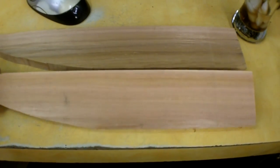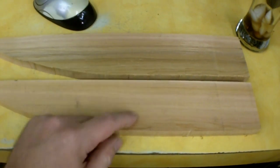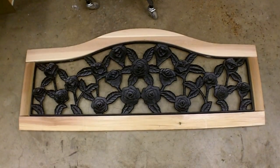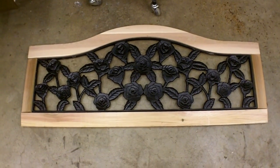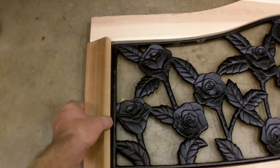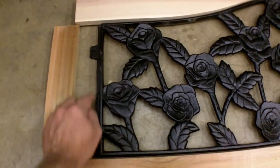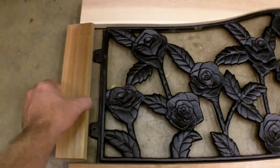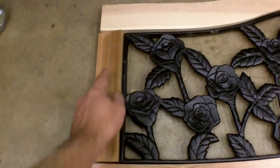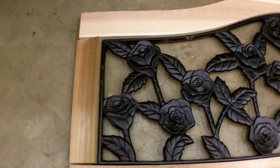While I'm waiting for my glue to dry, I'm going to go ahead and cut these two scraps to their final dimensions — they're going to be 2 and 3/16ths wide by 10 and 9/16ths long. It's certainly starting to look like something. Got it loosely mocked up here. On the original bench there's nothing holding these pieces together other than screws that run around its perimeter going in from the back. So I've decided I'm going to put biscuits in here and glue and clamp these on both ends, and that'll help hold everything together.